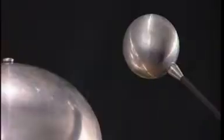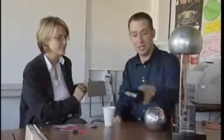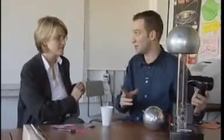It's not uncommon for Van de Graaffs to be a little bit temperamental and difficult to get going. If you've got a brand new one, then they tend to work very well. But over time, the belt starts to get a bit oxidised, and the belt doesn't carry the charge as well as you might hope. But heating it with the hairdryer is the right thing to do.